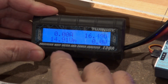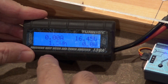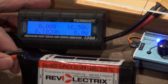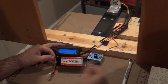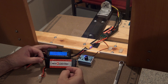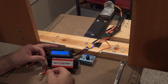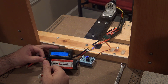Okay, looks like voltage dropped down about two volts — 1024 watts at only 67 amps. That's a little bit lower than what they show in their chart, but I'm probably running a smaller battery that still needs a couple of cycles. Still pretty impressive — over a thousand watts, which is quite a bit more than what I'm running with the monster jets. I believe we tested those at roughly a little over 700 watts. And this is a 7x6 prop versus the 6x5.5 I was running on the monster jet, so higher pitch too.